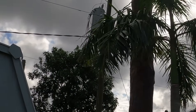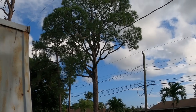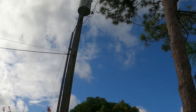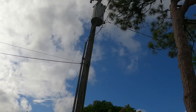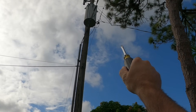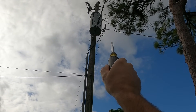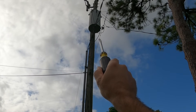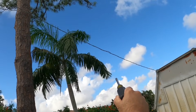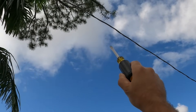Let's go over here and see what's going on. Where did they drop it — it fell on this line going to the transformer? They probably yanked it out of the transformer. You've got some very skinny wires heading into that house. It looks like it's pulling. There are two side by side — that's your 220 and that's a 110. If you look at the transformer lugs, there are three of them. The outer ones are 120 and 120, and the middle is your center tap which is your neutral. That ties into the bare wire that drapes. Oh, I see it — the line's busted! That's where it landed. They busted your line right here — it snapped all the way through. There it is, guys. End of story.